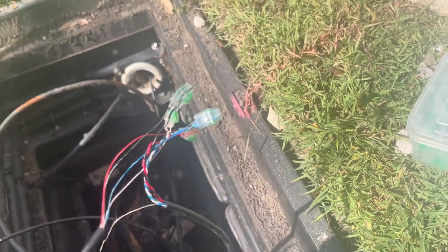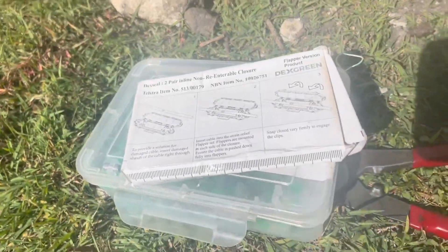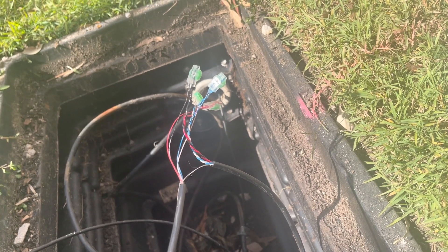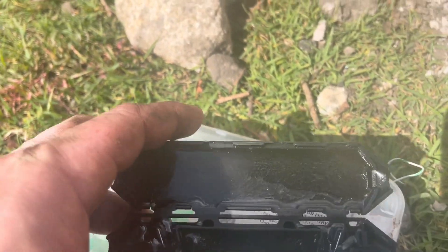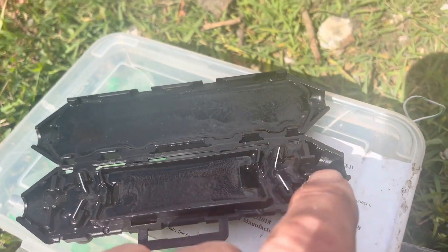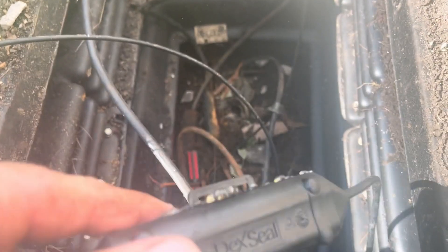I've joined the new leading cable and pulled it up to here, to the cable I've pulled back to the pit. The DPU is obviously down in that direction, so now I'm going to put the snot box on. You can see it's all open. These are what we call snot boxes. You put the joint inside here, down at the end, and this is like a sticky gel. That gel keeps moisture out. Double joint here - I'm going to go inside and test it before I put the lid on to make sure it's all working properly.